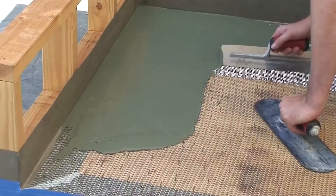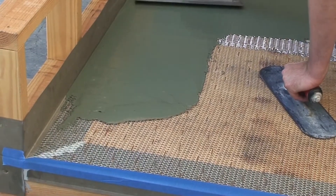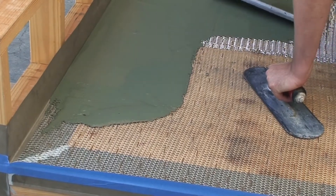Using a paintbrush wet with water, spread base coat on flashing, making sure to get the mixture into the corners and taper all outside edges to a smooth finish.